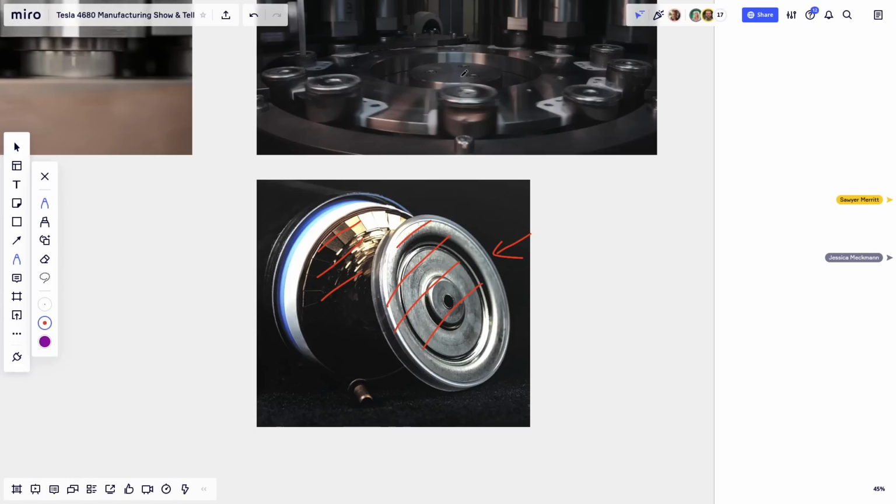So any questions so far? Right now in the process, we have cans that have their jelly roll in there. The cathode current collector is connected to the cathode nipple. The anode current collector copper is connected to the side of the can. We've inserted a cap, and we have crimped the side. Now the cell is closed. There's no way of going back in there except through that little hole right here that's left.